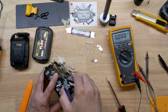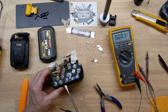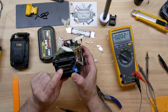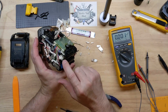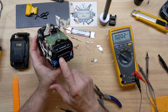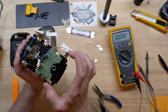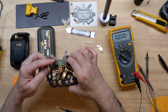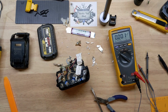We're starting to see if we can lift this up a little now. Our battery gauge here goes from here to here, so it looks like the battery fuel gauge just reads off of this 20-volt set. That connection is so short it might have to be removed as well. I'm going to take time to desolder my battery fuel gauge wire that comes over.